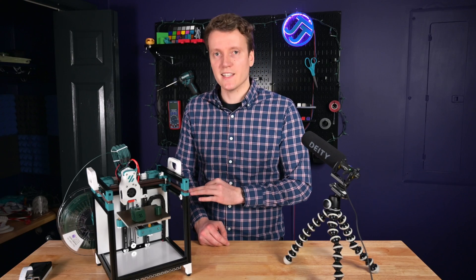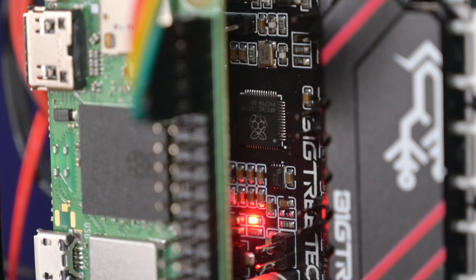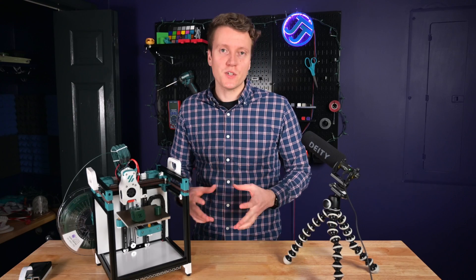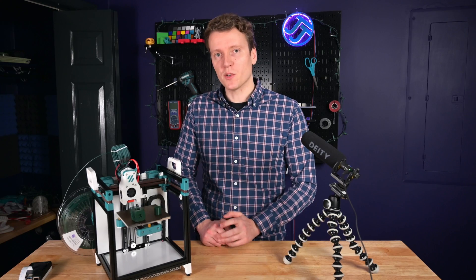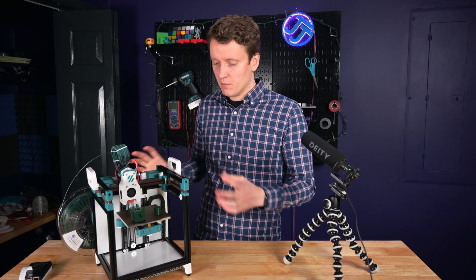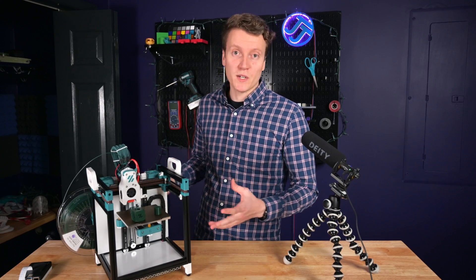The third big difference that sets this apart from other 3D printer main boards is the microcontroller: it's a Raspberry Pi RP2040. As far as I know, this is the first 3D printer main board that uses that microcontroller. It's a nice, fast, well-featured microcontroller, and I'll probably need to run some tests in the future to see just how far you can push it. One downside is it is the first one to use that microcontroller, so there might be some learning issues. I didn't have any issues setting up Klipper on there — it was nice and fast, super easy. That was one thing I was kind of wary about using a new microcontroller, but so far it's working really well.